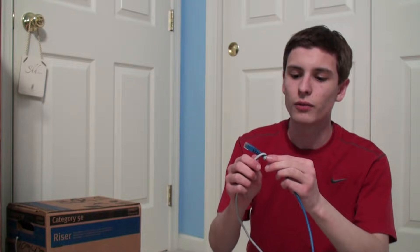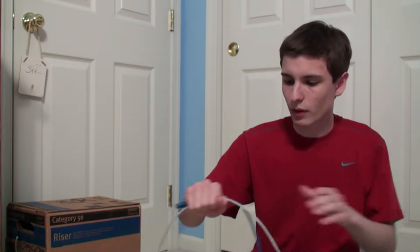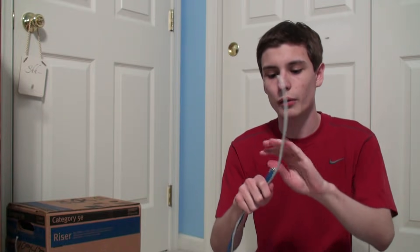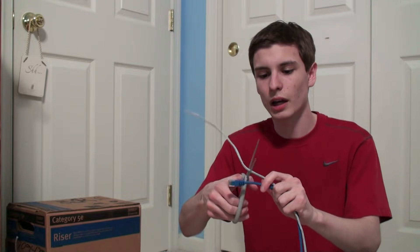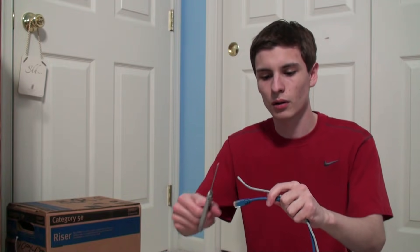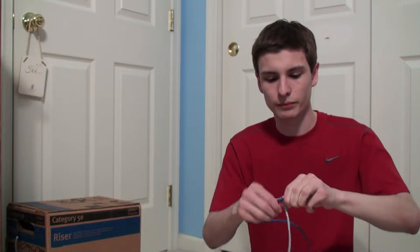The next step is the most important step, but it's still not that difficult at all — it'll only take you a few seconds. You have to wrap one end of your second cable around your main cable. It doesn't matter which is your main cable. Wrap three times around the end right below the base of the connector. Then follow the cables to the other end — I have a little bit of extra so I'm going to cut this off. Then wrap again three times around that end.